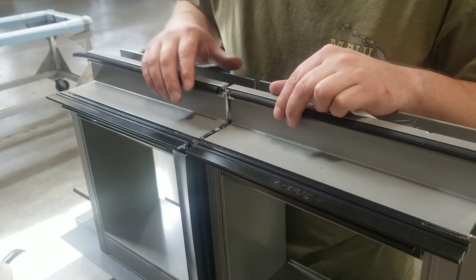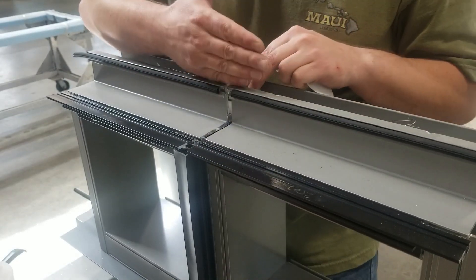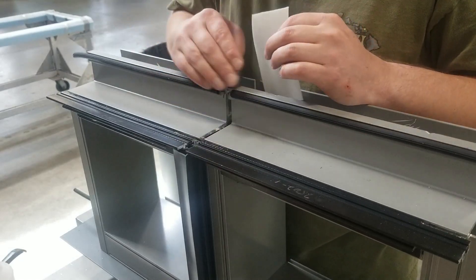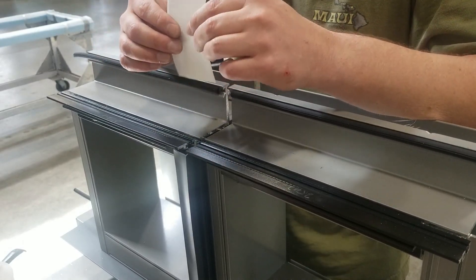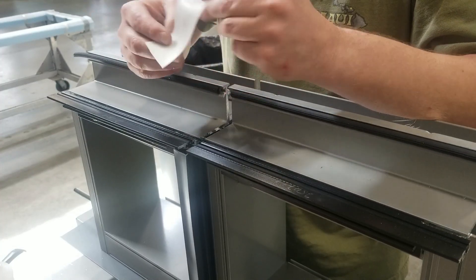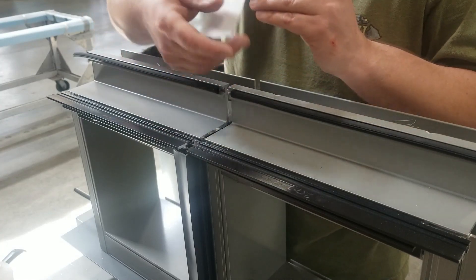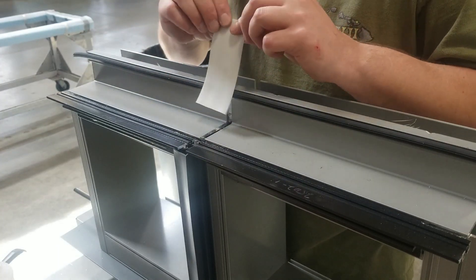We have about a quarter inch gap in between these two units — this quarter inch gap is the problem we're trying to solve. What you see in the middle is the chicken head. Everything on this side of the chicken head is considered a wet zone, so we're going to use this silicone boot to span this joint in the wet zone. Because it is a silicone boot, any silicone applied on top of the boot will not do us any good. Pay attention to where the silicone is placed — the silicone between the bottom of the boot and the top of the unit is what actually gives us the adhesiveness we need.